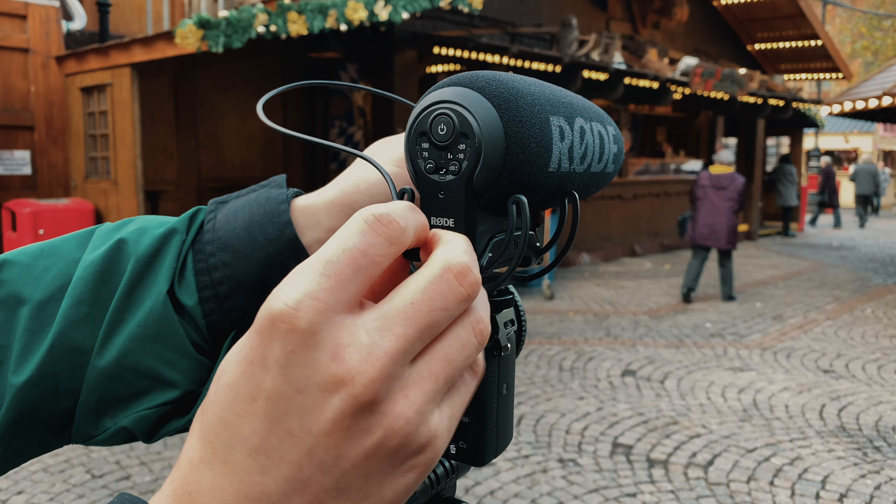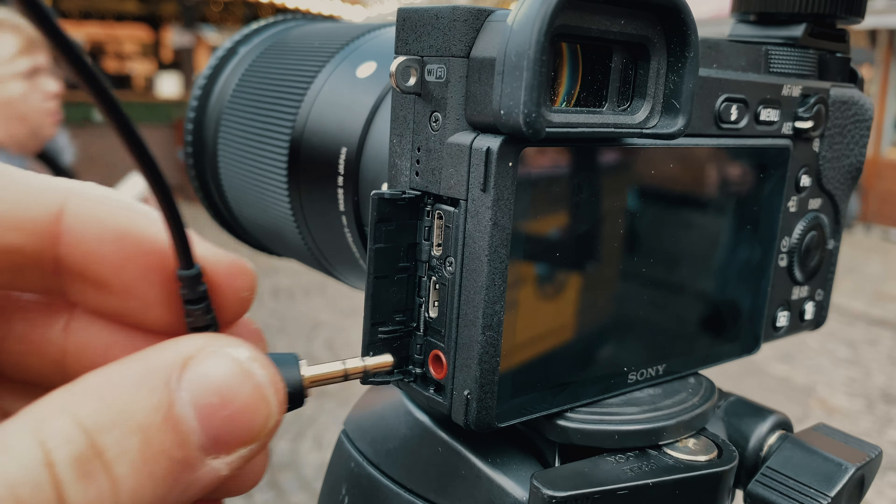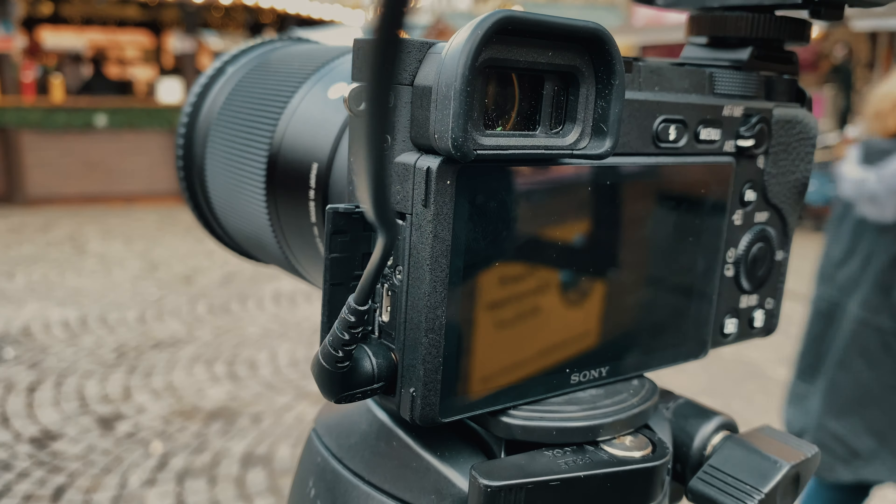The thing I really don't like about the old microphone is that the cable is non-user replaceable, and as you can see here it's become a bit loose, which actually affects the audio quality. What Rode has done is supply a cable that you can remove and plug in as you wish. If your cable gets damaged you can just replace it, and secondly you can swap it for an extender cable — so if you're doing a video show like this, you could have the microphone just above your head and use an extension cable to reach your camera.